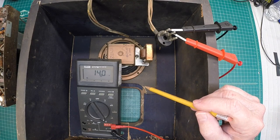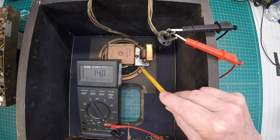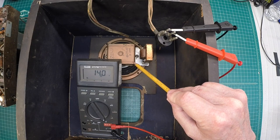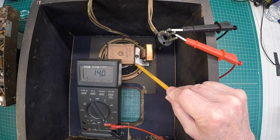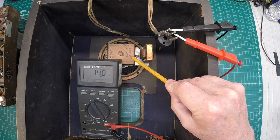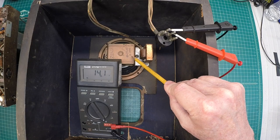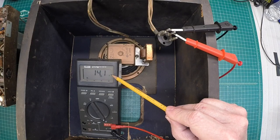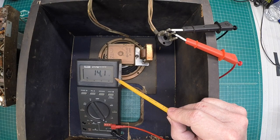After taking some time to look at the chassis and the tubes, I pulled the speaker back up to take a look at it together and see what kind of shape it's in. I'm assuming it's the original Zenith. The part number is not called out on the schematic, but you can see it's a 49-191 alpha-bravo. It lists the field coil to be 15 ohms for the 6-volt DC power supply. On this particular farm radio, the 6 volts is applied directly across the field coil. I have the meter hooked up here and I'm reading about 14 ohms — good there.